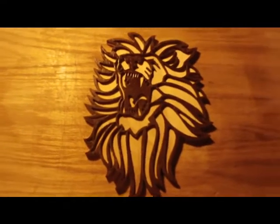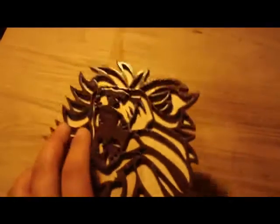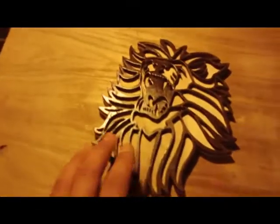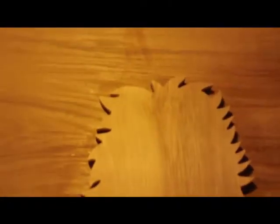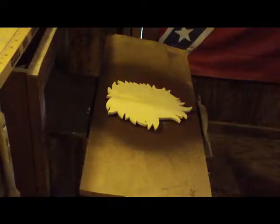What I'm going to do now is show you how to make the edges look better, because with the dark paint on one piece and the Baltic birch on the other it doesn't look right. So I'm going to paint the sides brown. I don't want to paint at an angle to the side and risk getting brown on the interior, so I'm going to flip it over and paint the side that way. If I get any brown on the back, it'll just sand away and it'll be alright.